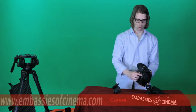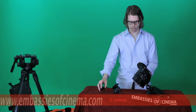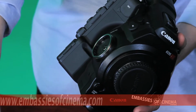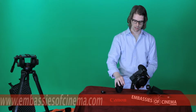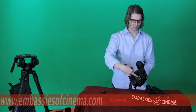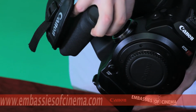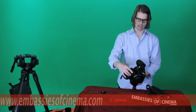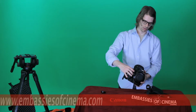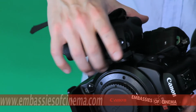So the first accessory we'll put on is the side handle grip, which screws on here. There's a small 1/8 inch connector that fits right inside this receptacle here. When you push it in, you just want to make sure that you feel that click. Good. And then once you've got that, just fit it in and screw it right on.